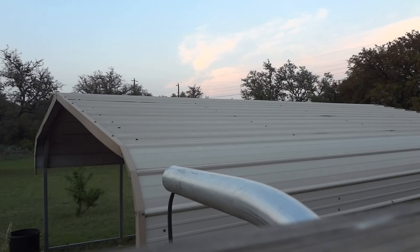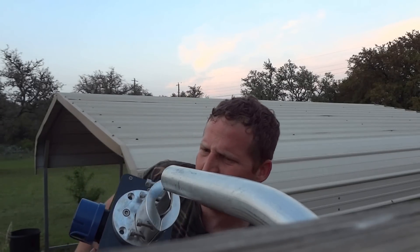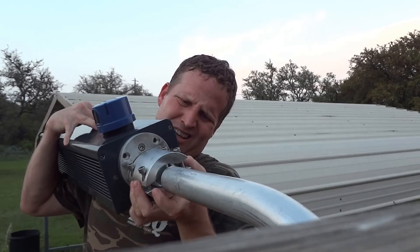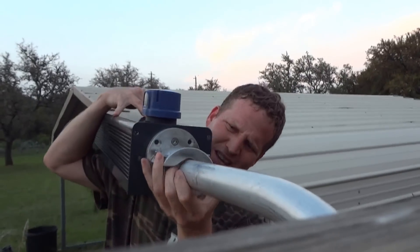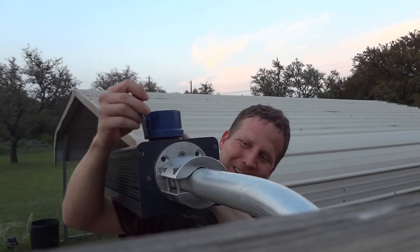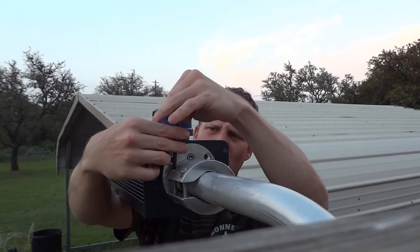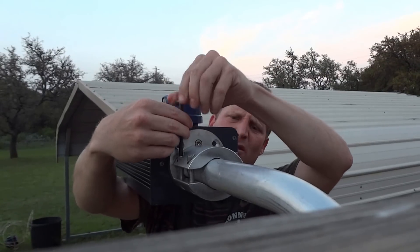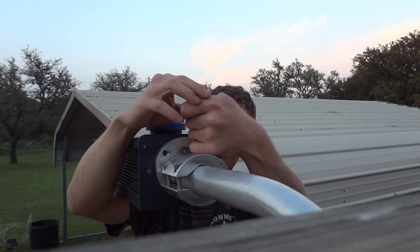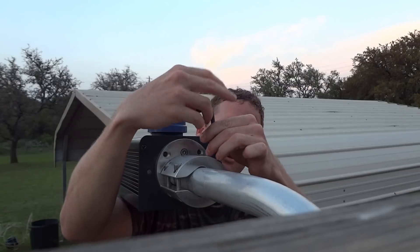Okay, I'm going to bring it up here. Basically just shove that wire back into this hole and give it a little hug. As you can see on top there, this fixture has got an analog dusk-till-dawn sensor — that's what PEC wanted. But we also have a digital dusk-till-dawn sensor. Just in case these analogs fail, digital is a little better than analog. But they wanted it that way, so we made it like that. Just secure these first, these two closest to the fixture — get those nice and tight, and you can pretty much let go of the fixture at this point.